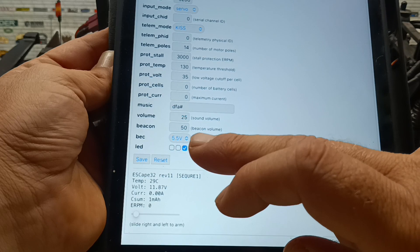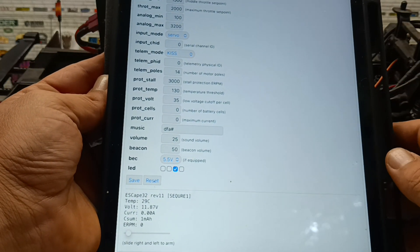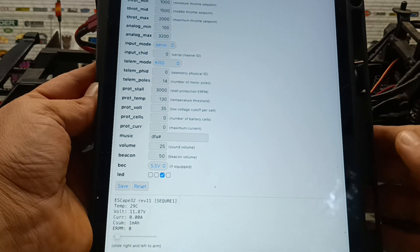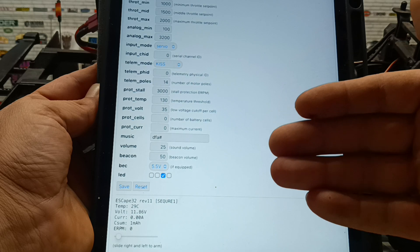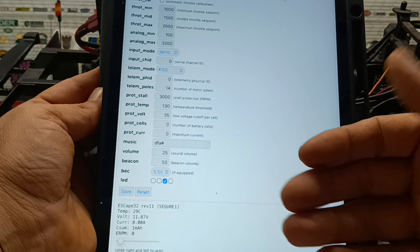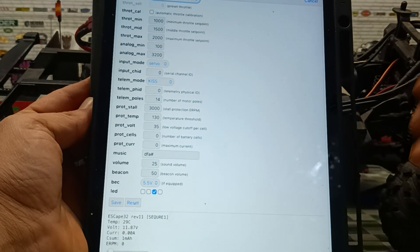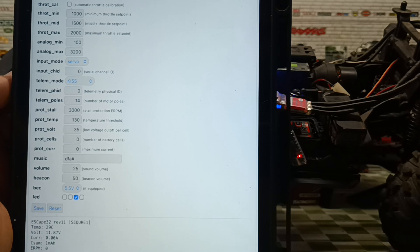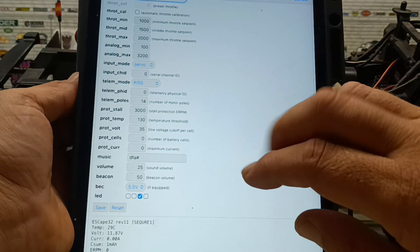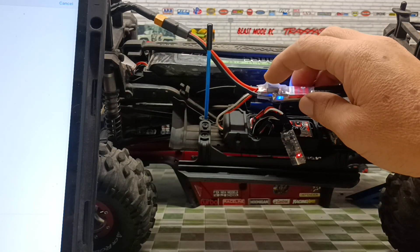Down here you have the BEC, which is incorporated in these electronics. The BEC is used to change the voltage to your servo. Depending on the servo you're running, you would want to change it from 5.5 to 6.5, 7.2, 8.2, or even 12 volts — that's insane, it's got loads of power. It depends on what servo you're running. For example, I'm running an Epsima Combat Series servo which can only run on six volts. Changing it through the WiFi link isn't available yet — in future versions you'll be able to do that, but at the moment you have to change it by soldering two little tabs together on the electronics.